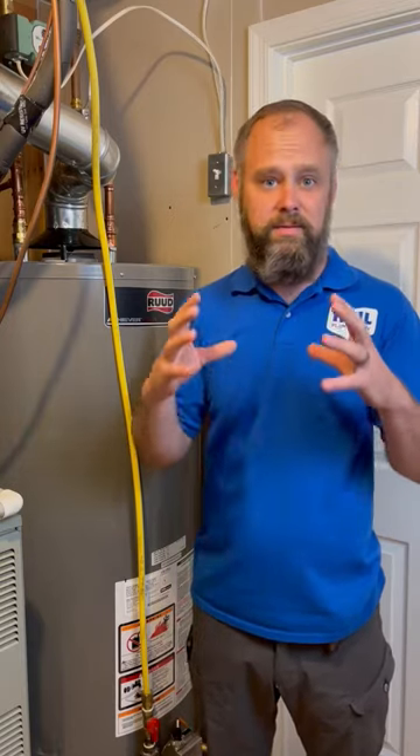We only recommend that you do the draining of the water heater if it's a newer one — every year and kind of keep up with that. If you have an older unit in your house, six years or older, a lot of times that sediment has already built up and compacted, and you could try to drain it out but for all practical purposes you're only going to get a little bit of that sediment out. You could actually have like a five-gallon bucket full of sediment that's just compacted at the bottom of the heater and it can be really difficult to get all that out. So your efforts might be kind of wasted if it's older and you haven't really maintained your system.